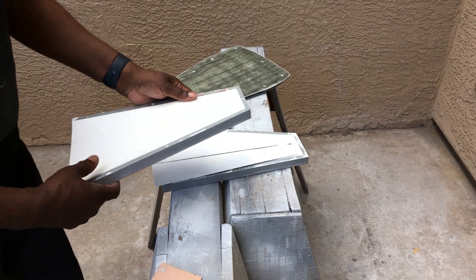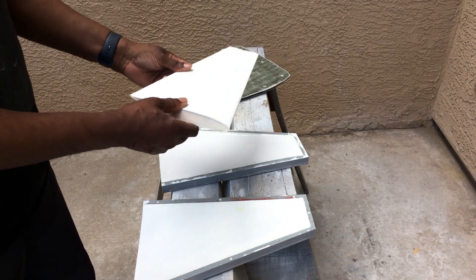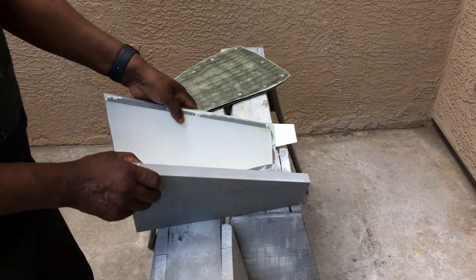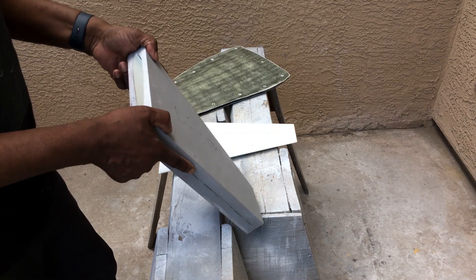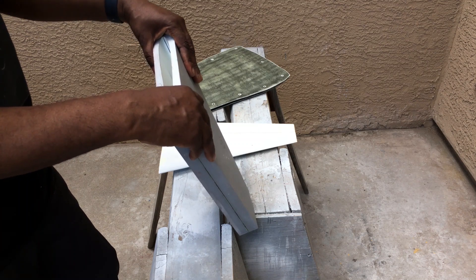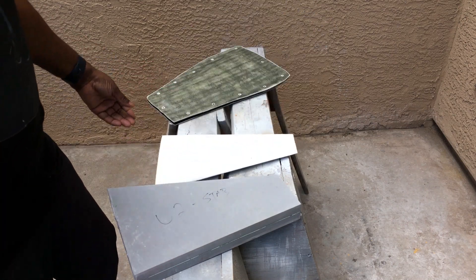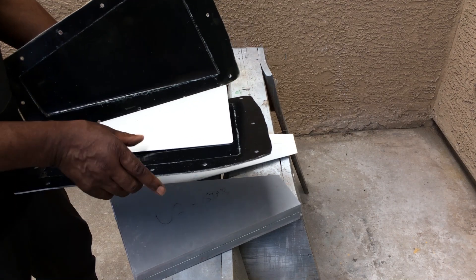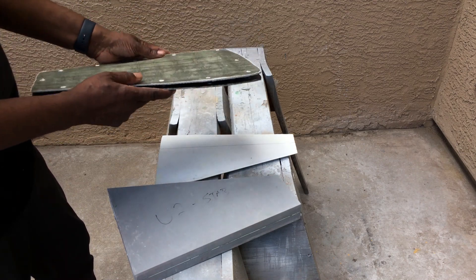This is the 3D printed mold I made of the U2 and I went ahead and laid up one stab already from these 3D printed molds. In my opinion, if you only need like one or two parts, I would recommend just go ahead and 3D print the molds — it's a lot faster. But if you need three or more parts, I would go ahead and print the part and prep it to make traditional molds like this, because these are very sturdy molds and you're probably able to make hundreds of parts. So if you just need one part, 3D print the molds, but if you need more than one or two, go ahead and make traditional molds like this.